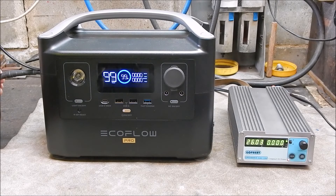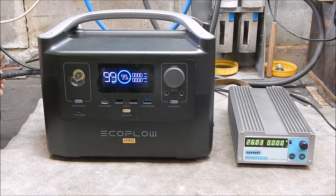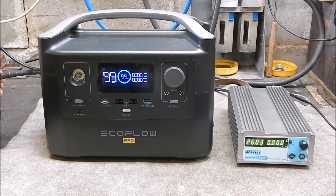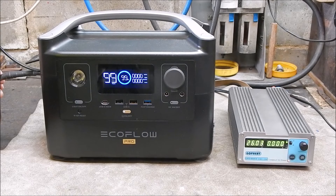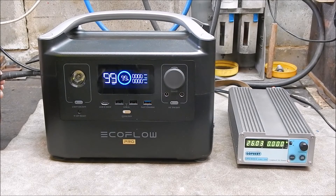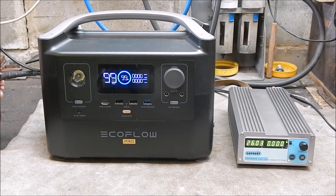Remember that as panels heat up during the day, the voltage will drop. So if you try to connect a panel in the morning and the voltage is too high, if you leave the panel in the sun and it heats up then try again, you'll find it's quite likely the panel will feed in — provided you're only just slightly over the maximum. Have a read up on how heat affects panel performance. All panels are rated at 25 degrees centigrade, which is your sort of average temperature where people are out and about.